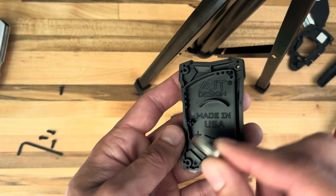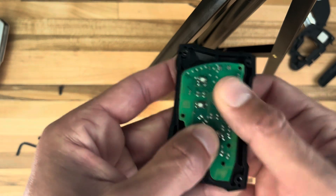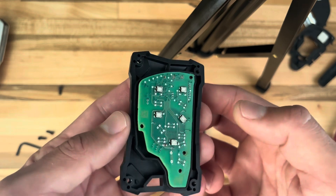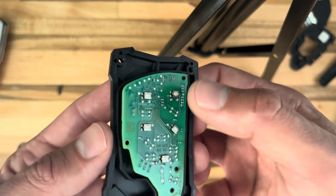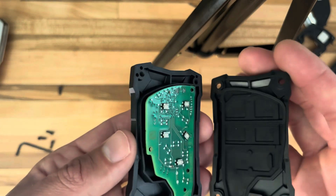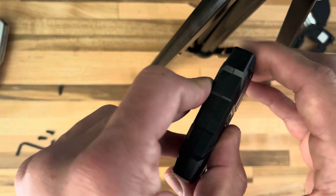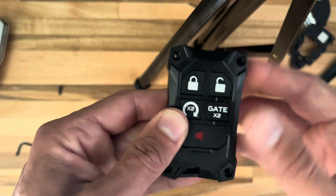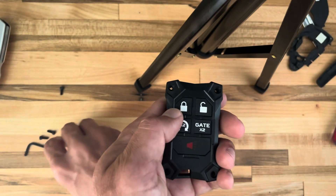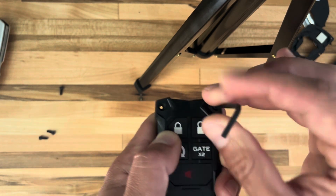Next, insert the battery plus-side down as indicated, then put the board in. The board is located on these four pin holes. However, when you let go it's going to want to tilt up, so press it down on this side so you've got these two pin holes holding it in really solid — you'll have a little bit of a gap there. Take the case and sandwich it together. If you do it right, it should go together very easily. If you see any binding, start over and do it again. Then take the screws and put it together — don't use Loctite, get them snug but don't overtighten.